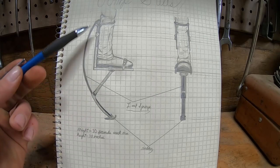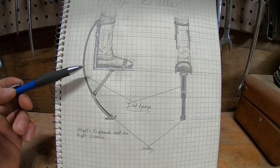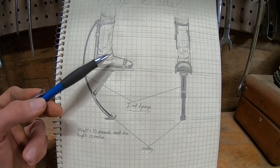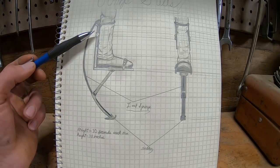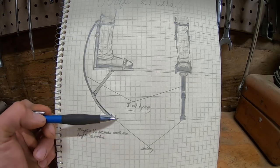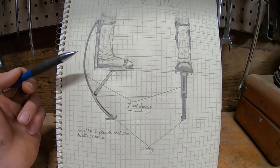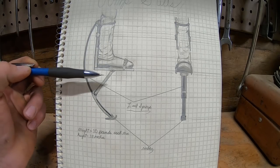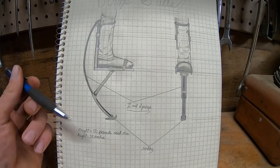The design is pretty simple. It's basically just a solid piece that acts as a framework for the whole thing that attaches to your leg. There is no joint here — it's a solid L. You have a way to fasten your foot in securely. You've got a solid metal brace up here to keep your leg in place, which is adjustable by four nuts. Then you have the spring going down to the contact point to the ground, which needs to be a high-friction surface. And you've got a piece that keeps the relationship between your foot and the spring, with three pivot points in total. The concept is very, very simple — it's the execution I'm worried about.